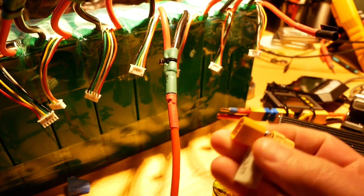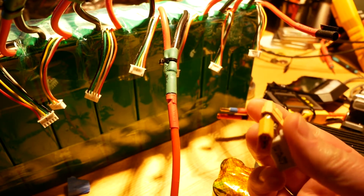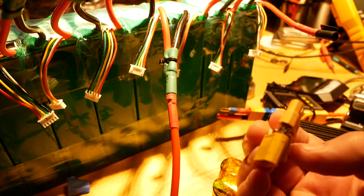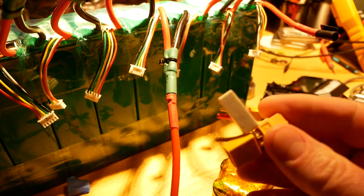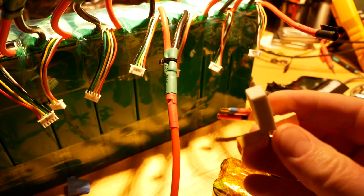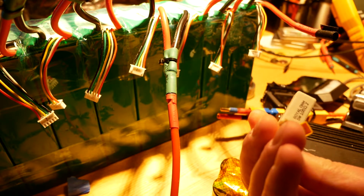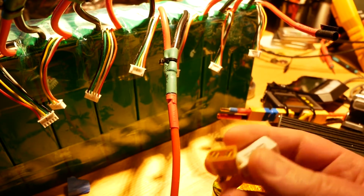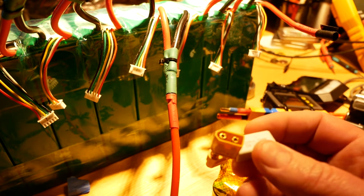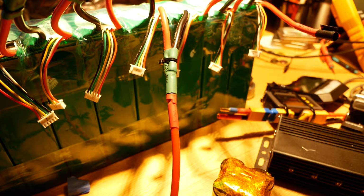Anyway, I've yet to see a wheel that includes any kind of pre-charge. This is one of those areas where China has basically skimped, saving themselves a couple of pennies on a resistor of all things. I mean, these things just don't cost very much money. And you didn't even have to use a big one like this, because this is a 5-watt resistor. They could have used a 1-watt resistor, and those things cost like 50 cents, that's me buying them from DigiKey. Whereas in China, they make these things by the billions, and they cost them like a penny each. Anyway, that's all they would have had to do, and they didn't.